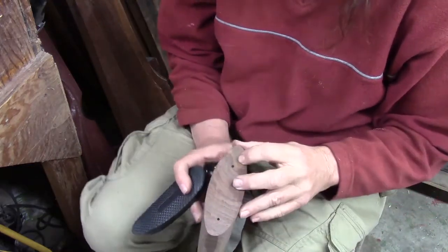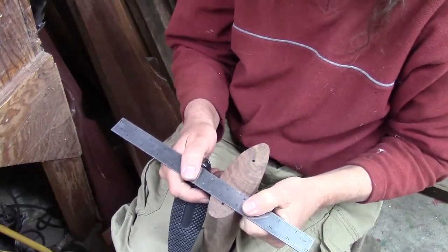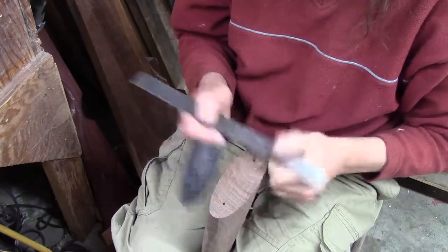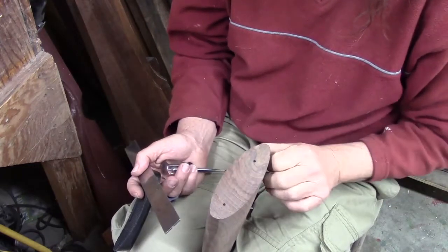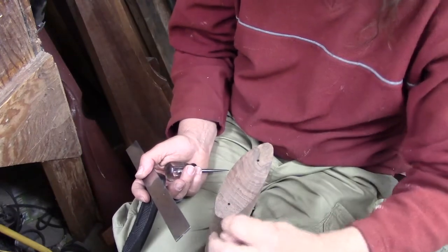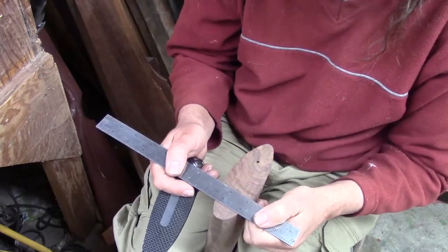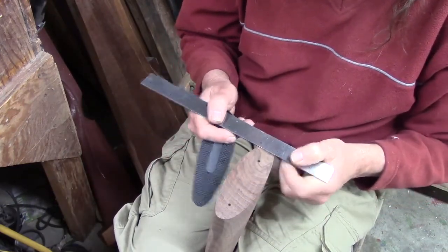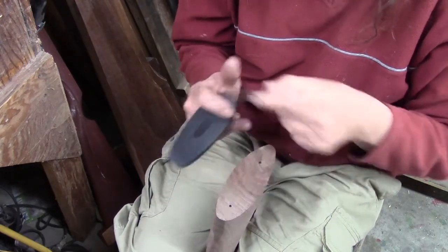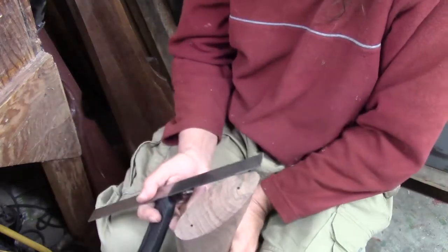The way I got that line is by measuring the center, left to right, and identifying the middle in a number of different locations, because this is always going to be a rough shape at this point. It's not perfectly symmetrical, so it's not something you can really use as a datum to judge the middle of the top to the middle of the bottom. That's not going to work. So I find the center in a whole bunch of different places and then get the average of those to draw the line. Then I put the gun stock upside down on the workbench